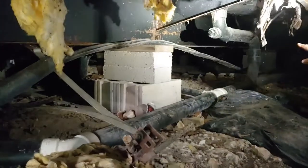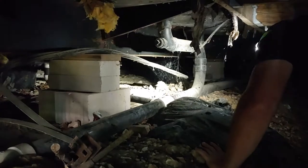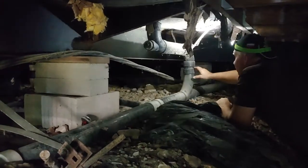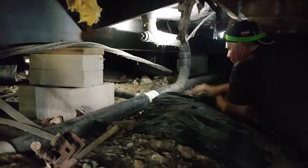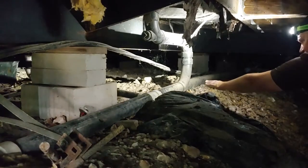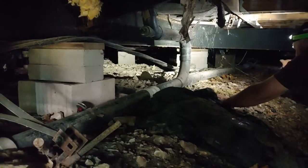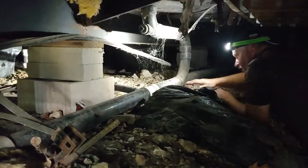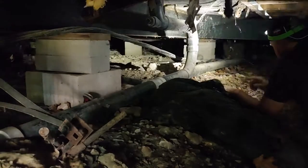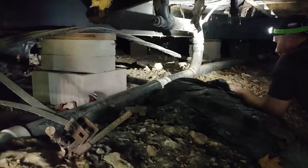In this case, you can see the sewer line right here — there's like an inch between here and here. You could cut up here if you wanted to come down, or you could dig underneath. You have to keep it up. It's running down here from here to here, but it's also running downhill that way, which means it should probably be raised up there. Because the water will outrun the solids, the solids will sit in the low part and you'll have smaller openings. So you want a gradual fall.